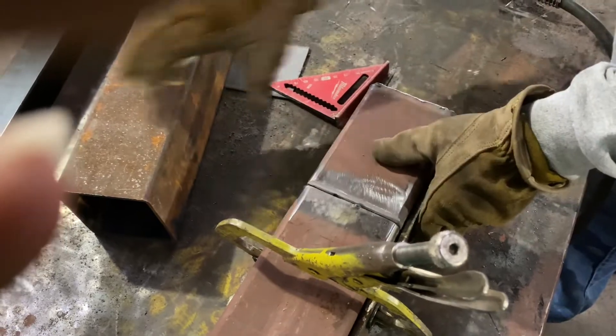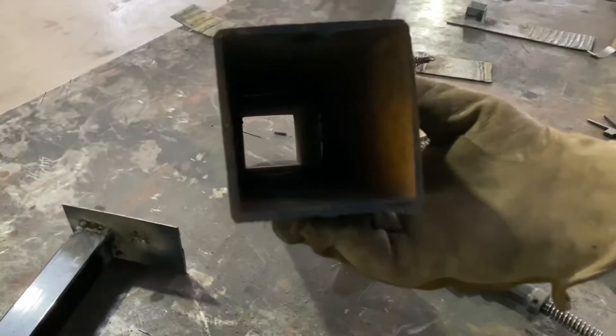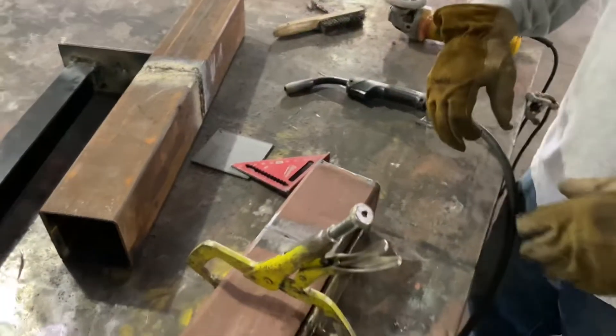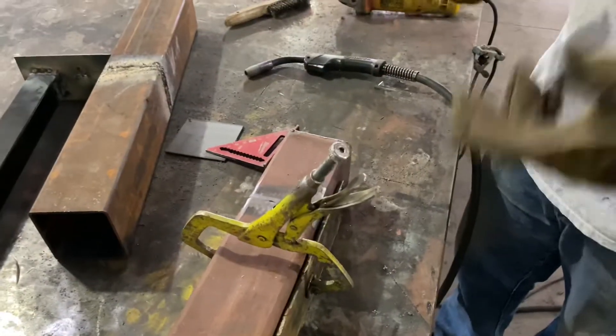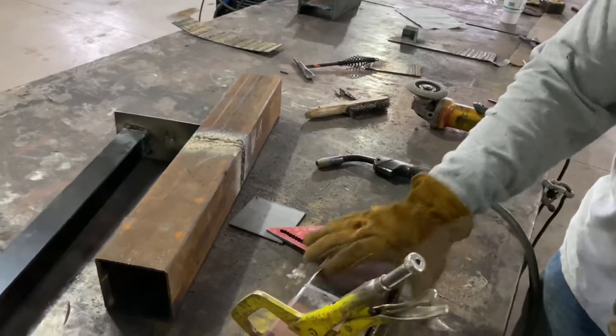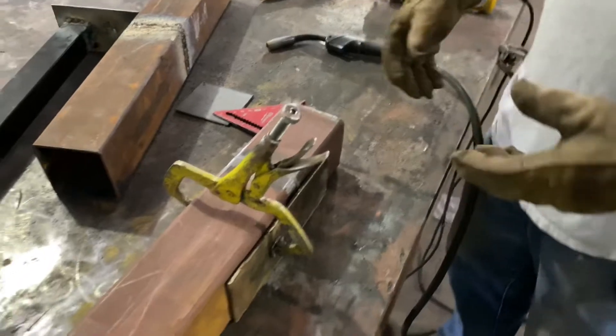If you let it go, it's going to move. This one was done yesterday, and if you look down it you can probably see it's not straight, because none of what I showed you was done — that's what happened because of the heat. So for future reference, that's what we want to do when you're stitching something together: utilize your clamps, utilize your table, just use your tools. It takes some extra steps, but in order to get the proper result, that's what you want to do.